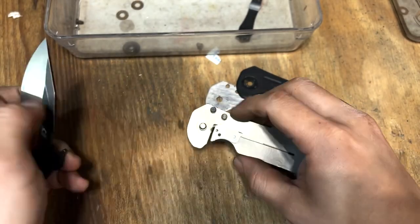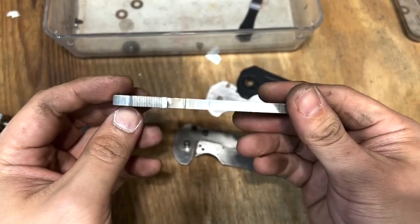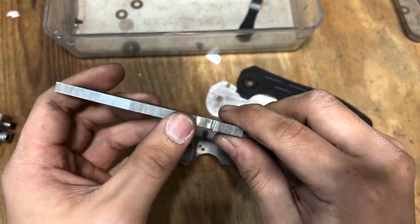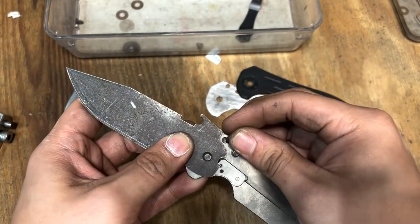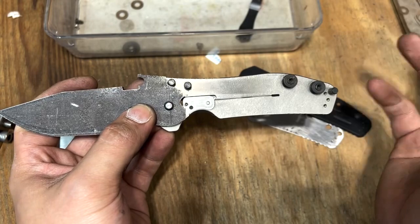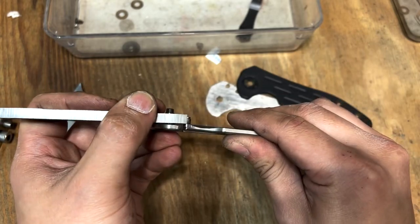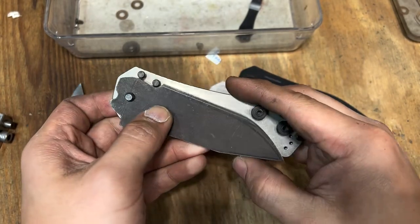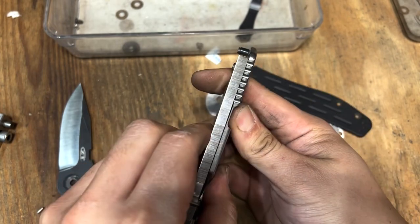After a little bit of a shop upgrade lately, I've decided to do a re-blade. This is Cruwear — the stock is actually quarter-inch thick, but I'm going to surface grind it down thinner so it matches better. Right now the fit-up is okay; I'm not going for a perfect fit pre-heat treat. I'm going to walk it in a lot closer. You can see there's still plenty of lock bar for me to cut into for the lock.